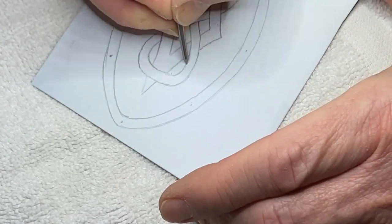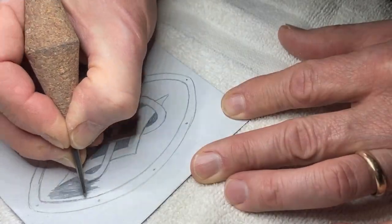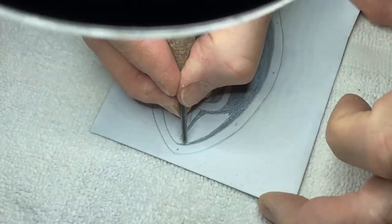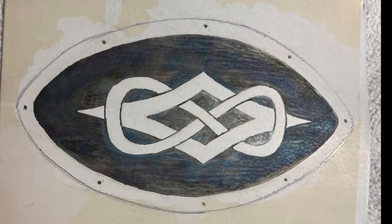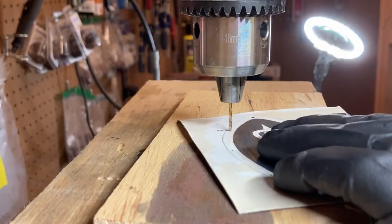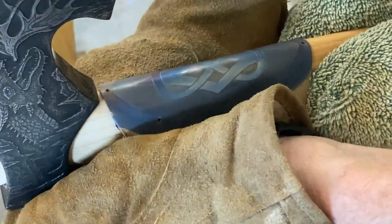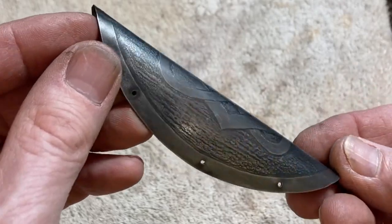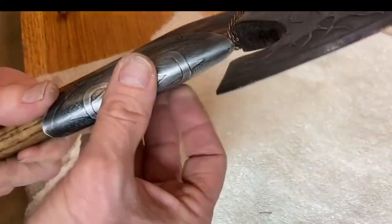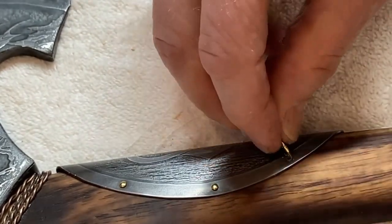I now move on to the bellyplate design. I am forming the bellyplate out of sheet steel. The bellyplate will be etched with the same knot design I created for the hammer on the back of the axe. The etching process is again the same as for the previous pieces. Prior to bending and fitting the bellyplate, I drill the eight holes around the edge that will be used to secure the plate to the handle. In order to achieve a good fit to the handle, I heat the steel plate up to assure it is more malleable. Then I form the hot steel around the handle. Once I have a good fit, I can finish shaping the bellyplate. The bellyplate is secured to the hickory handle using brass nails.